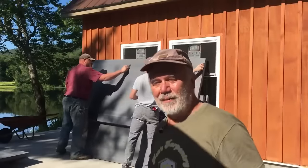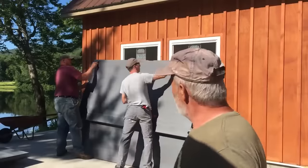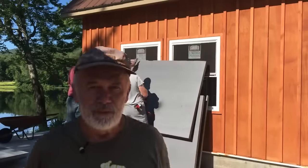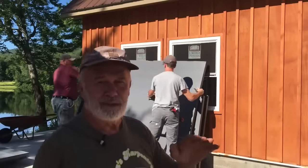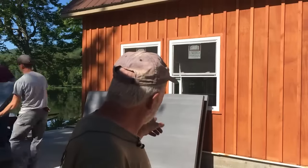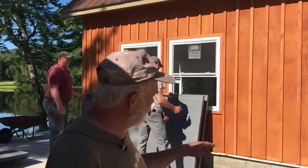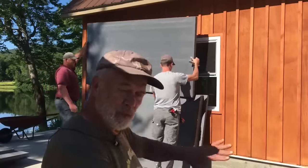Here's another big day. We're getting ready to do the foam insulation around the concrete. So the directions for the sealant, the paint, call to rough up all the foam, so they're doing that ahead of time. Then we'll rip that. We're going to use liquid nails to adhere it to the wall.